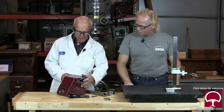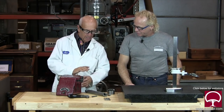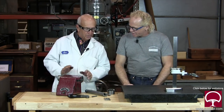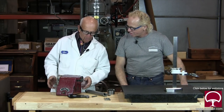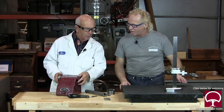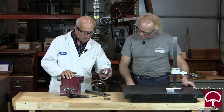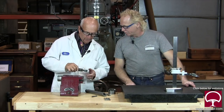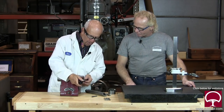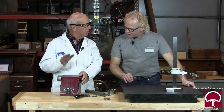When you bore this out and make another one of these, we'll make it to the new size. We've already checked it here. It's got a little bit of a taper — about three thousandths higher on this end than that end. But that isn't going to make any difference; we're not going to need it that close. For this application, this thing is pretty good. So again, we're going to remake this part and this part. We've already done the handle — ground this down, bored this out — and we'll make a shim for that, then put it all back together and put it on the machine.